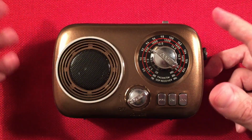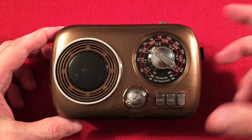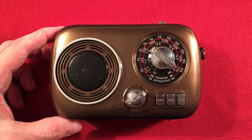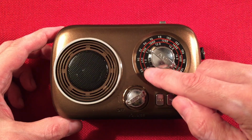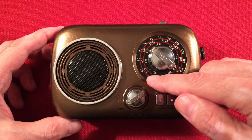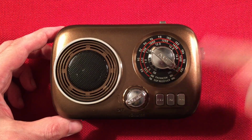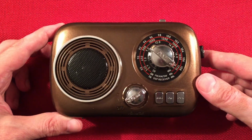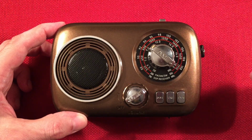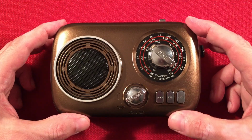The solid reception, all three bands, you heard it. Amazing. Hidden segment too, being able to tune all the way down to 3.2 megahertz and then have that spread from 3.2 to 8 now. That's key right there, because right here you've got 5.9 to 9, a little area to play with. On the hidden one, you've got this entire area on the dial, 3.2 all the way over here to 8 megahertz. That's nice if you're tuning low on the band at night. You're going to like this radio on shortwave if you can get that in-between switch trick to work. Fantastic, I was loving that.